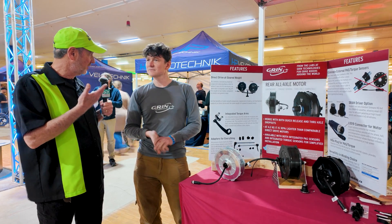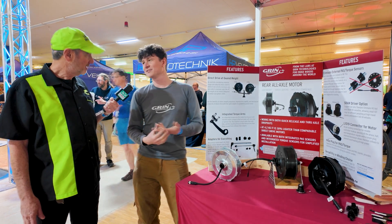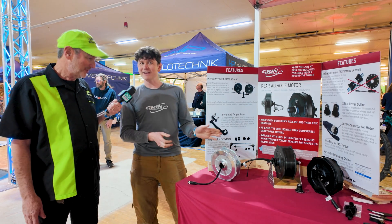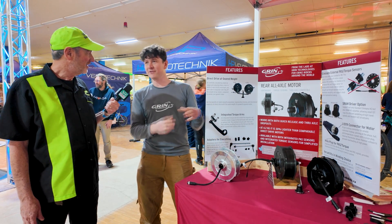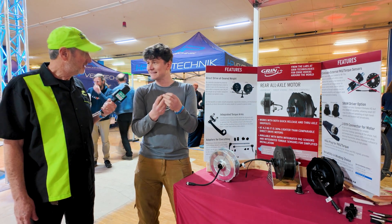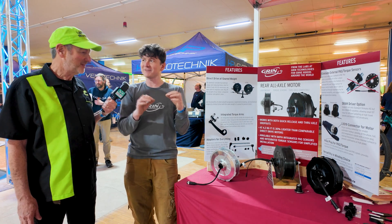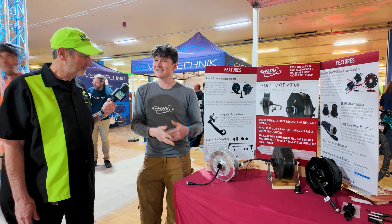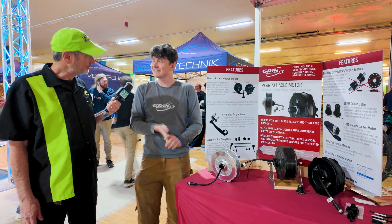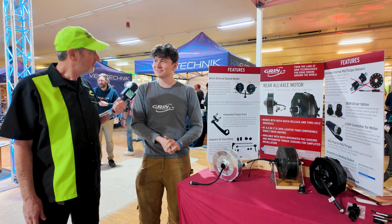Is that a permanent seal? Does it need to be replaced? We're now six years into running it. I imagine after 20 or 30 years there might be some chemical breakdown. Ferrofluids have been used extensively in hard disk drives — that's how they sealed the original platter hard drives, so no dust would get in. They also use them in speakers, and in these applications they're lasting years and years. Worst case, in 10 years you might need to add another half a syringe full.